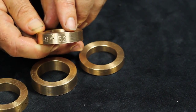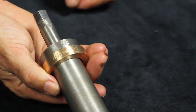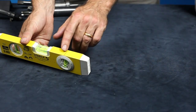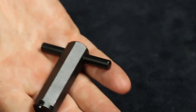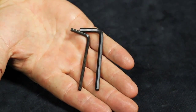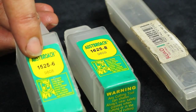There are five bushes corresponding to handrail diameters of 40 to 60 mm in 4 mm steps. The spacer bush slides onto the 16 mm cutter. Two clamps are used to clamp the drill jig onto the pipe at the required angle. A spirit level is used to set the angle of the holes. A file is used for dressing the holes where necessary. The insertion tool screws the Mini Pucks in once the holes are drilled and tapped. The drive adapter connects the drill with the tools, and two metric allen keys are provided to change damaged or blunt tools.